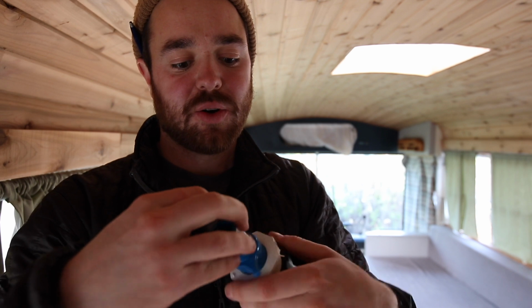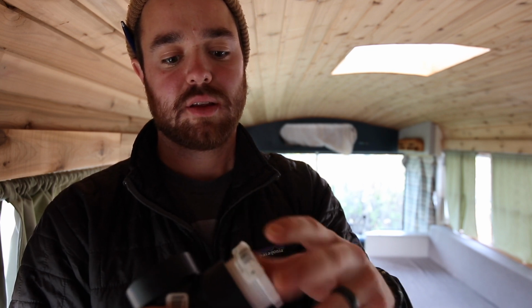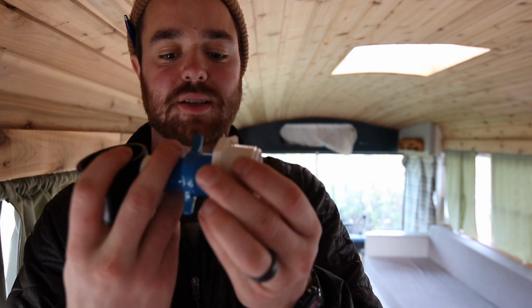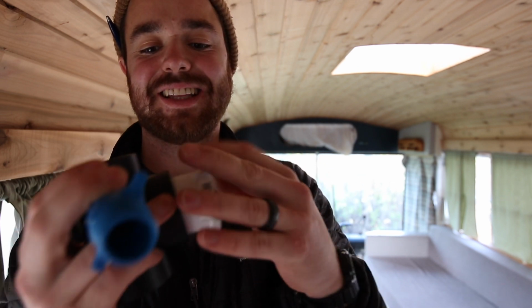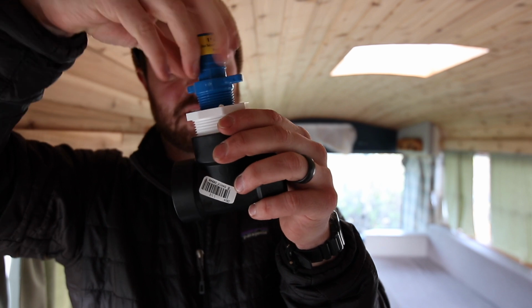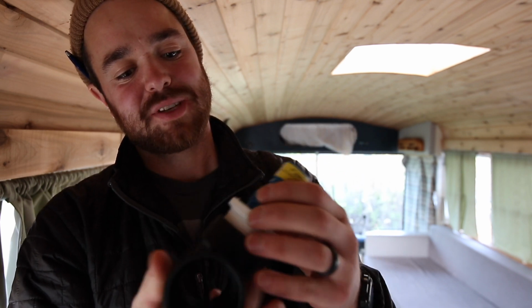It's called a 1-inch insert to MPT. So this is threaded, and then this is the push in for the vinyl tubing, and then this is reducer bushing. So this threads into this, and then this is a clean out T, and so this threads into there. Bam, like that. So it goes from vinyl pipe to PVC to ABS, and I'll put some pipe tape in between, and then this will go on our existing pipe, and hopefully we'll be done soon. I think I'm gonna come back and finish this up tomorrow.